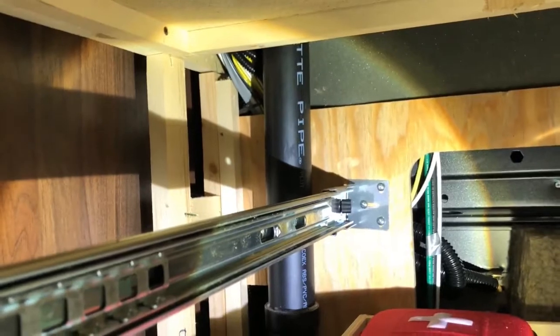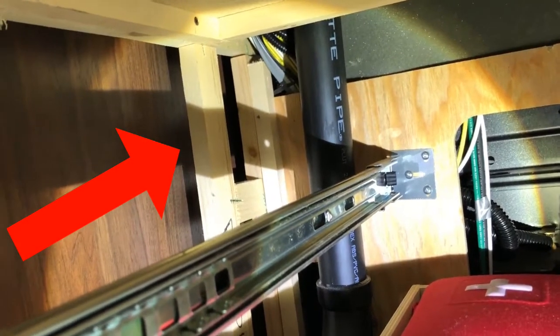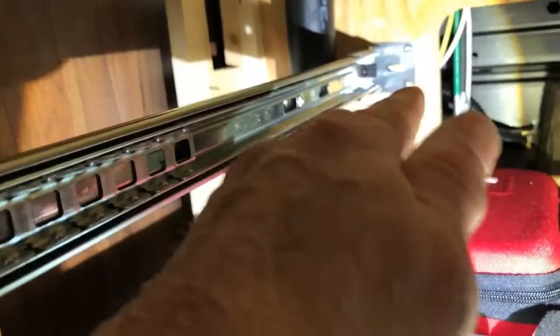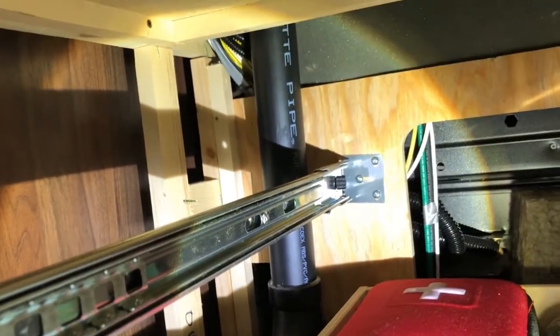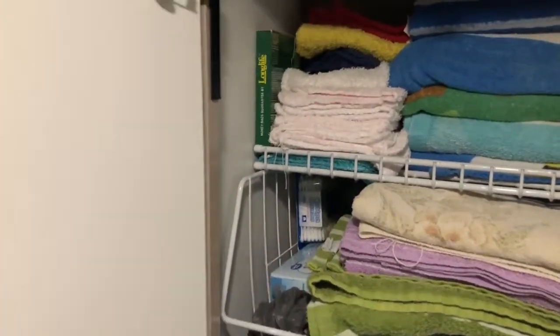There's just not enough room to get to the wiring going through here — even if your arm was long enough, the gap between the unfinished wall and the finished wall is too narrow to get even a skinny hand through and manipulate things. So, as much as I feared, I'm going to have to come into this closet and take out the side panel. Fortunately, I've taken the panels out of this cabinet before, so I know I have to take the vent pipe protector out of the corner, unscrew the side panel, and push the floor up just a tad.